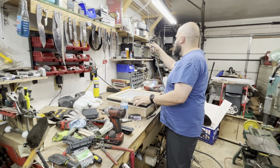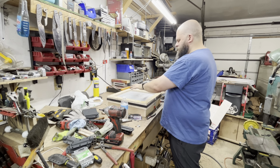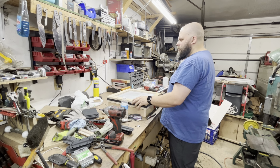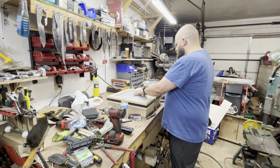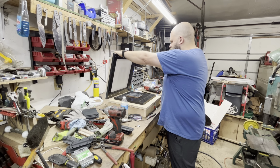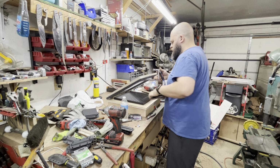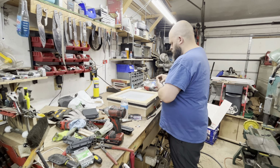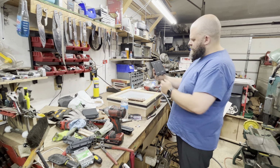So I've got my piece pressed and cooled down now. Just gonna blow some extra dirt and debris off the top. You want to try to keep your silicone as clean as you can. You don't want anything getting pressed into it that's going to make a little tear or hole and compromise your vacuum on your next form. So try to keep it as clean as you can. Take this out, blow the dust off it. Now here's our very nice and defined mold.